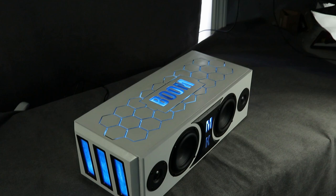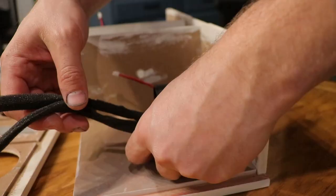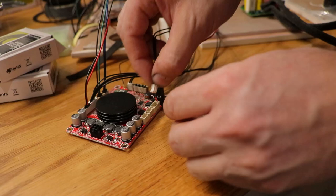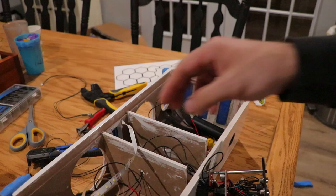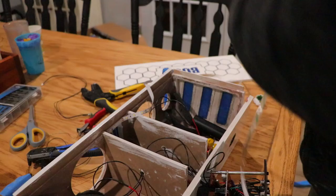I got to say, I'm really digging the way this came out. This boombox is designed for anyone to do — it's really a beginner boombox. Everything is literally plug and play except for plugging the speaker wire from the amplifier board to the crossover; you do need to solder those four total wires. But other than that, everything else is plug and play. One thing I found out later: the way the amplifier goes in was going to cover up my really cool epoxy work, so I laid those in on the side — they were a pain to get in. But otherwise this was a really simple and easy build. I did make sure to add those LEDs, and boy did that make a difference. Let me go ahead and show you the final project — I think you're going to like it.